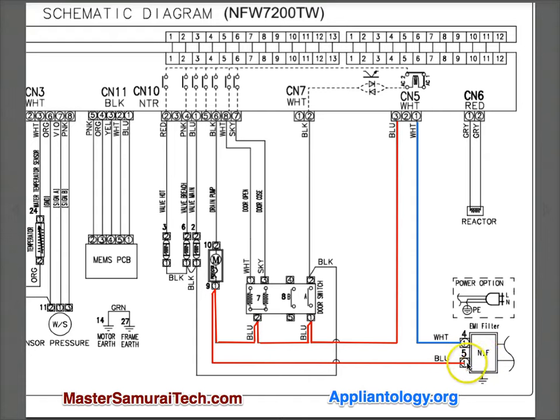Line is on the red wire and neutral on the blue wire. I've gone ahead and traced out the low-hanging fruit - the stuff that's easy to identify. Line comes through these components up to pin 3 on the CN5 connector. Then neutral just comes in here, hard neutral, unswitched, up to pin 1 on the CN5 connector.